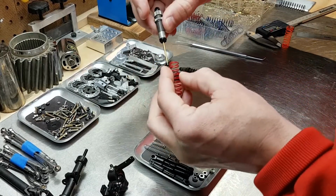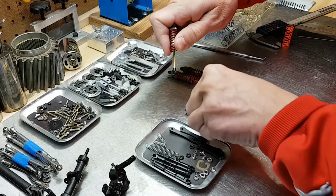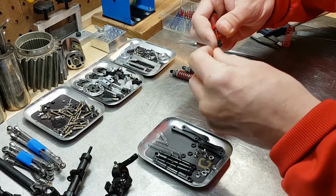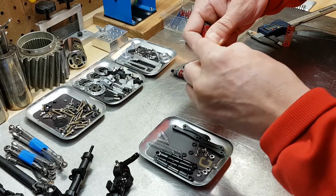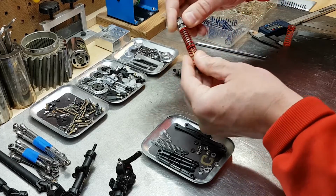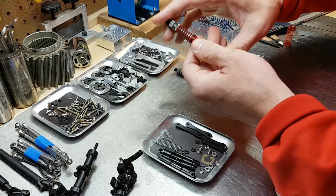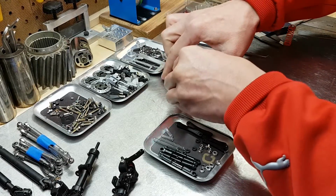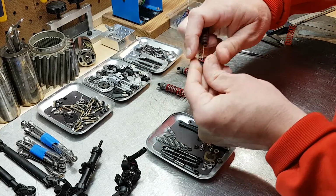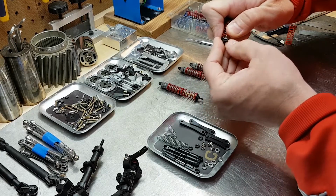So on the front coilovers, I'm using two of the heavier short course springs stacked on top of each other with a plastic retainer between them. The original springs don't have a lot of tension in them, so I'm not sure at this point whether or not they're strong enough to hold the truck up on their own. I'm thinking now that the housings and the shafts in the rear coilovers are shortened, the full-length crawler springs should be strong enough to do the job.